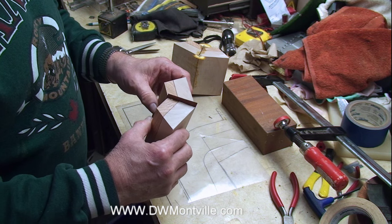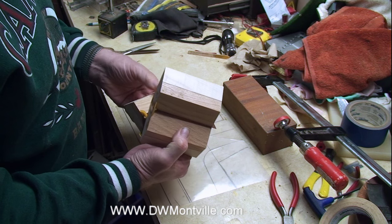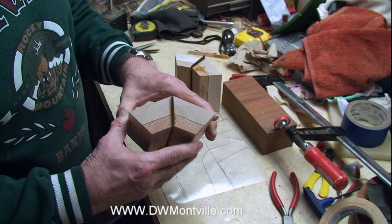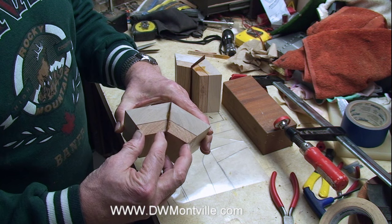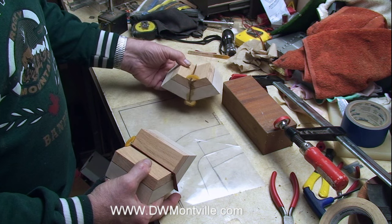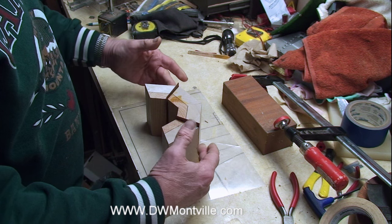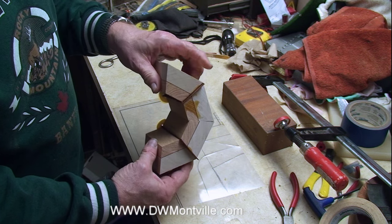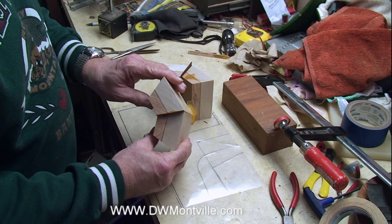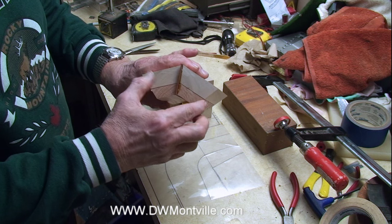This is for a project I'm working on. I'm using the gluing board from a previous video right now for another part of this. These pieces are going to be part of an eight-sided glue-up — these are the 22-and-a-half degree angles I've cut. I've glued two pieces into two groups, and now I have to glue them together. To clamp this, there's clearly no place to put a clamp — just no place to apply clamping pressure that won't slip off.